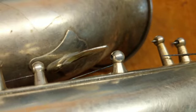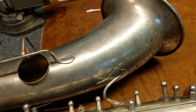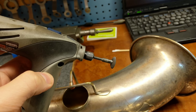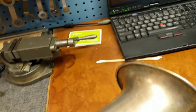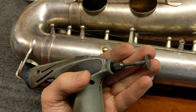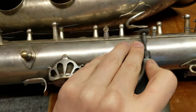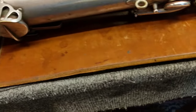I have now cleaned the solder off of this joint using the scraper I showed you and also a silicon polishing wheel and a Dremel. This is a very worn-down one that starts off larger and they come in different grits. The black one is good for removing solder but it will remove the finish extremely quickly, so only use it for solder. Don't throw them away when they wear down because they're good for getting into tight spots.